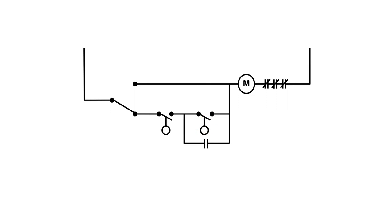Let's take a look at what happens when we get these two float switches in their closed positions. So both float switches are up, the M coil is energized, this set of contacts is closed, and away we go. Now let's say that the power is gone — this will de-energize and this set of contacts will open. However, when power is returned, we still have a path. These floats, as long as that level is up, are both being held closed. So it has a complete path to get to M. When power is returned, we'll see M fire up.